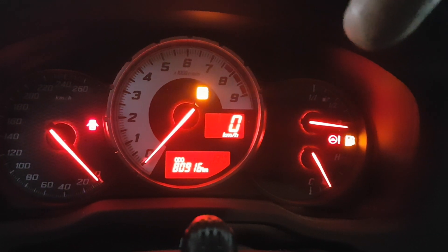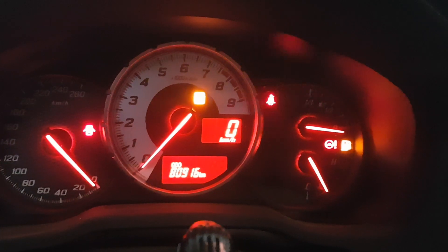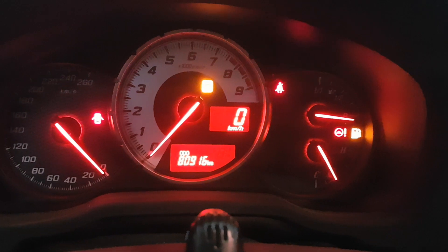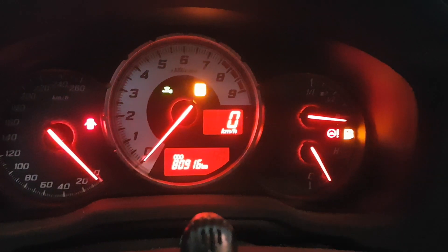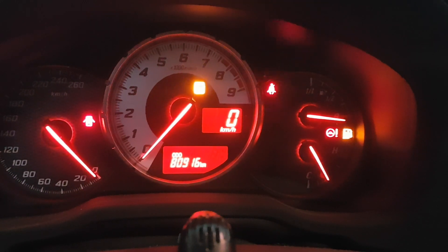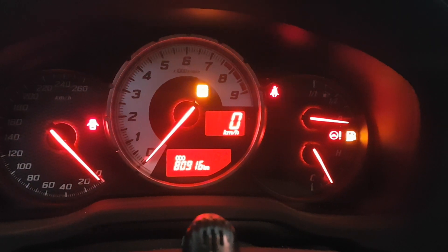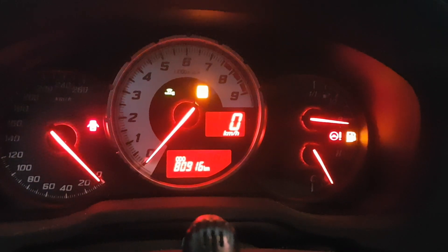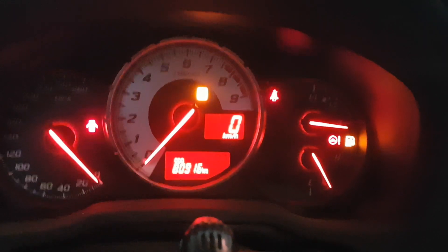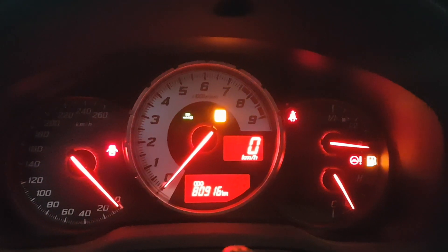From time to time you can see the MIL turning on — that's still something in my code I need to get rid of, but that won't be a big deal. The temperature gauge I got working. I just added a few degrees to the CAN signal because I have 20 degrees on the motor right now and it would show zero otherwise. Usually this should be around 70 degrees, and I think I've set it to around 60–63 at the moment. I can change that any time.